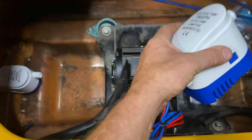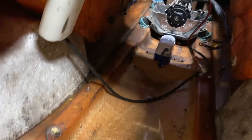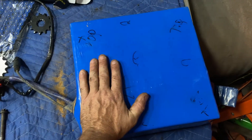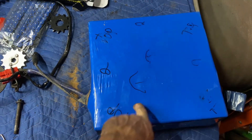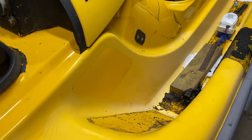I'm also putting two bilge pumps in here — one in the rear and one in the front — just in case, hooked up to their own separate 12-volt battery. I'll be building a battery box right here for the actual 72-volt battery. It's a Kawasaki empty hull now, very lightweight. These are the big batteries — massive things. It's a 72-volt 5,000-watt battery, 72 volts, 100 amp BMS continuous discharge.